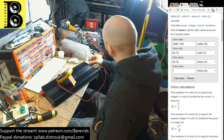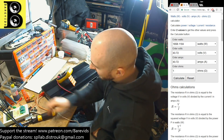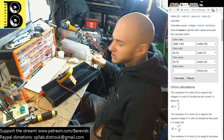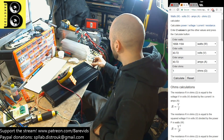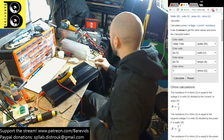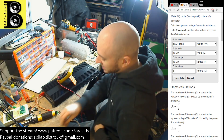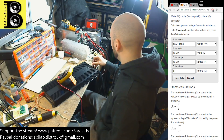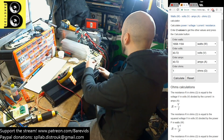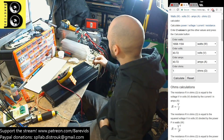The only thing delaying me at the moment is my supercapacitors — my ultra caps — seem to charge off balance. I tried it with and without balancing boards and some of them reached like 2.5 volts while others in the same parallel bank are only reaching 1.3 volts, which is very strange. That's the thing delaying my 14 volt supply. The 14 volt supply will consist of two server power supplies with about 300 amps of charging supply, a lithium battery, and two banks of Maxwell supercapacitors. I should have a very solid supply for doing these bench tests.